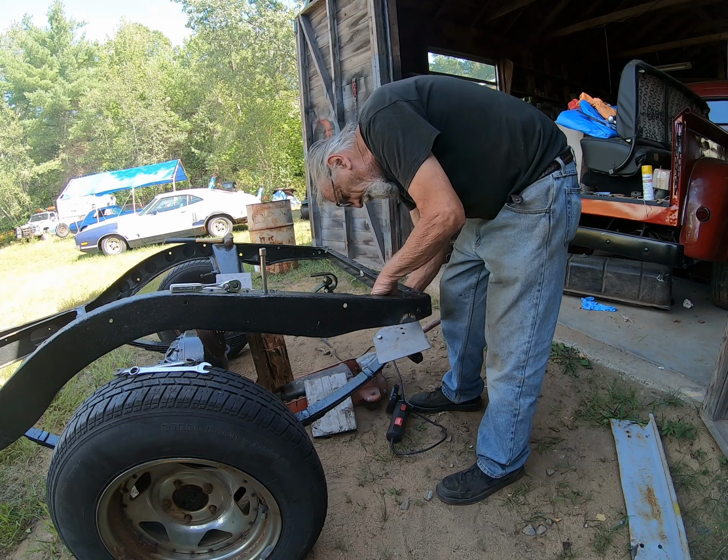All right, we're all set up on the milling machine, Super Max, and let's get that hole. There's the first hole. Get this junk off my machine. Okay, we got the first one done. We're right on 0, 2, 4, 6, 8, 10. Right on 0 there, that's 1 inch. Okay, so much for center drill.